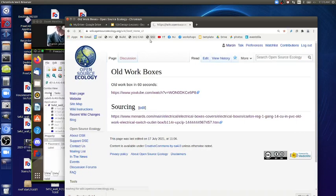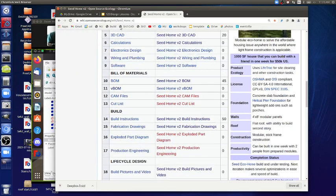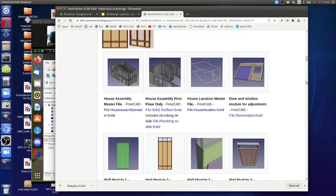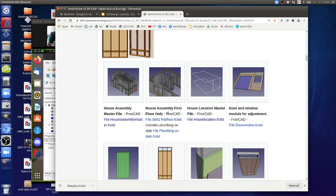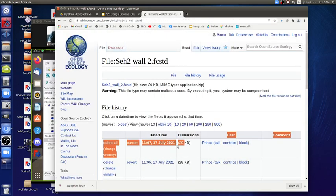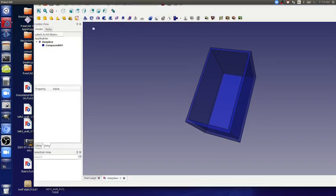Let me see if I get the same issue on my end. Wondering if there's constraints. Well, you're able to do it. Yeah, this rotates around the line, but when he tries to rotate his, when he clicks here, it sets the line out there. So you just set it right there and then rotate. So you're in draft and you just right click and rotate? It's the shortcut, so it's just RO and then you can draw the line. Or you can just type in the amount of rotation manually.